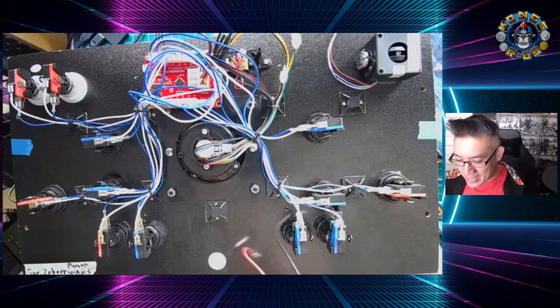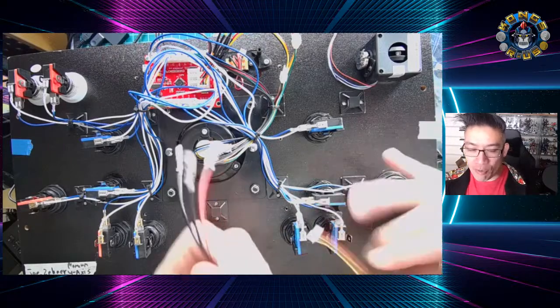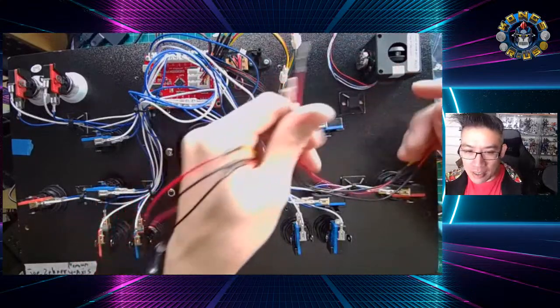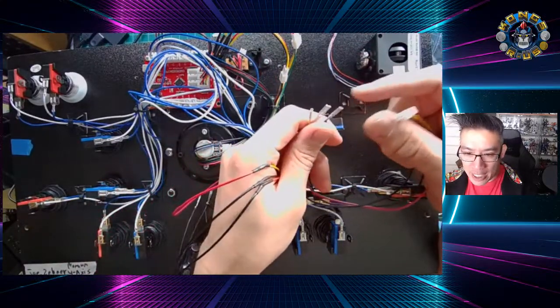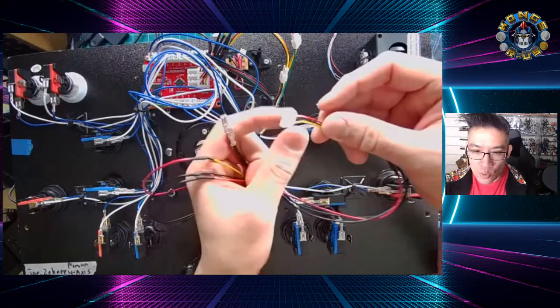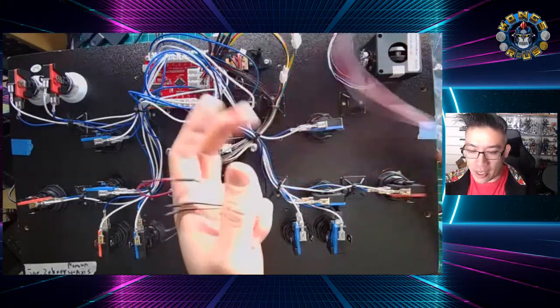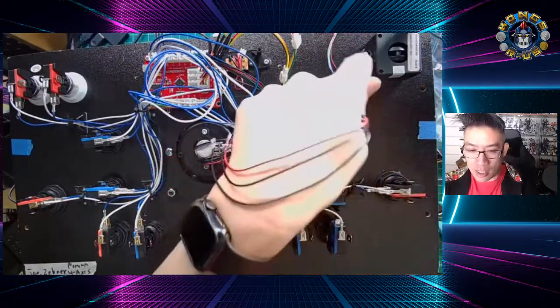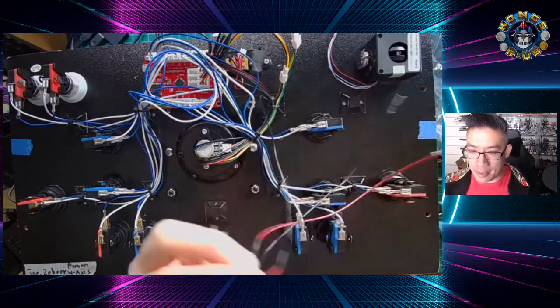Okay. So in my mod kit, and this is again for what I provide, these are kind of smaller encoder connections, and they are plugged into this 3-pin JST connector here. And the way I have it labeled is I have one red and two blacks for each of these that are going to go in the potentiometers here.